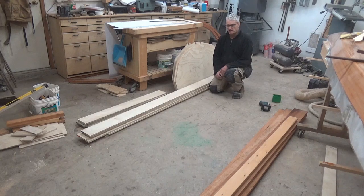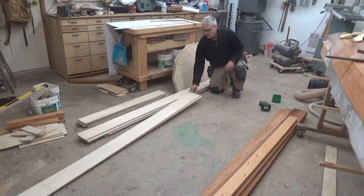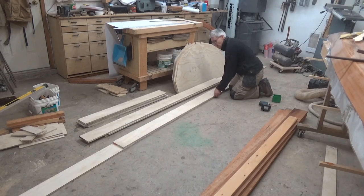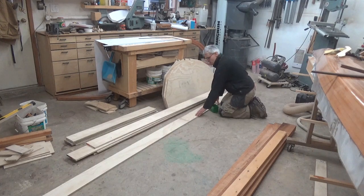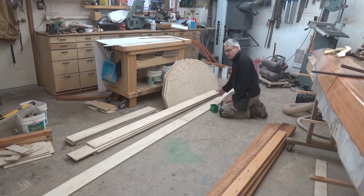I'm going to do it a little differently than I did on the little Acorn, the last one, whereby I used two by eights or two by tens. This one needs to be 15, almost 16 feet long — the strongback — so we're going to build it somewhat like a ladder. My plan is to take two straight strips of plywood I've cut out, lay another one across the joint, some shorter pieces on the ends, and tie it together with some two by eights. We know the edge of the plywood is nice and straight, cut on the table saw using the factory edge. I was concerned that a two by ten at 16 feet long wasn't actually going to be all that straight or level. I'm hoping this will all be stiff enough once assembled.